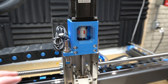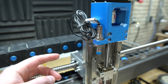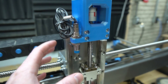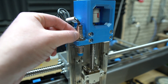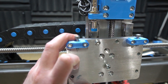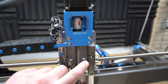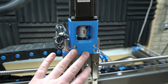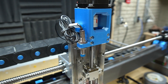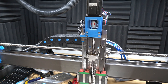Moving up, this is a motor mount that I have revised — you can see I have my new limit switch on here. The limit switch I had before was mounted on the side and ran horizontally. It did the job, but it was mounted in a way where I had to use only the last couple of threads and it was sticking way out. I revised this mount so that when the plate comes up it bumps against the limit switch. I modified the Fusion file and modeled this limit switch mount. It's not a huge change but I think it'll be more robust for homing the Z-axis.